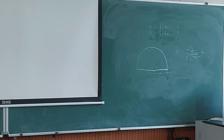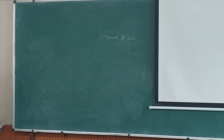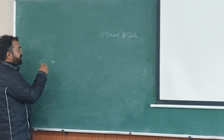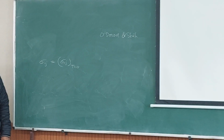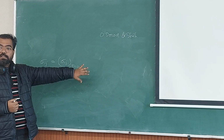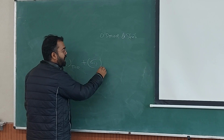So remember that T stress is not discovered by O'Dowd and Shih. T stress analysis is done by O'Dowd and Shih. What they discovered was something else. If you come back to the Williams expansion, we have a first term, then a second term, but there are other terms also. So these people defined the stress when T stress is equal to 0. That is the first term. So T stress equal to 0 says that the second term is 0. It doesn't mean that the third term is 0. So this will be equal to sigma ij and whatever is there, the higher order terms.